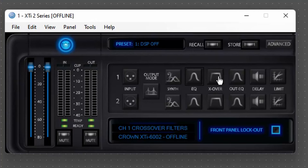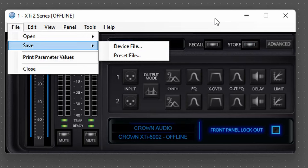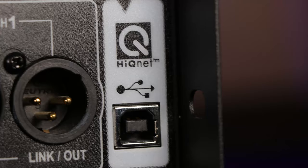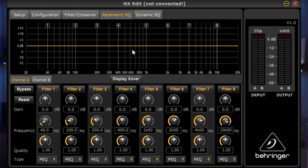The reason you're only going to run one subwoofer on the Dayton is its DSP feature. Both the Crown and the Behringer offer standard DSP — you hook up your computer via USB and use their own apps. Crown uses HiQnet and Behringer uses NX Edit. You'll need a calibrated microphone at your listening position, and with some knowledge you can DSP it to whatever response you want.